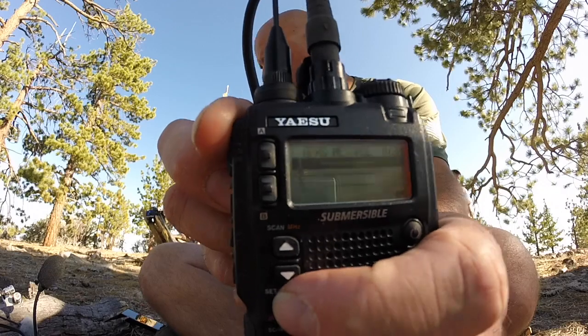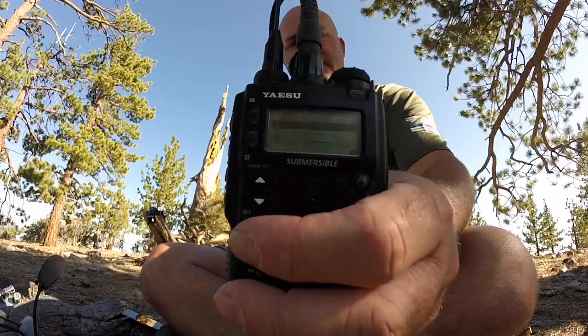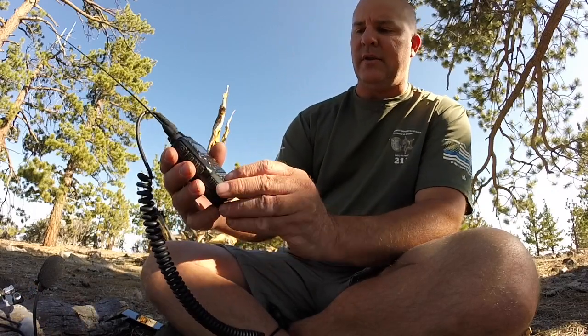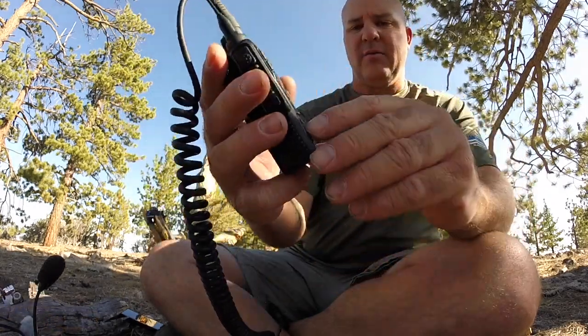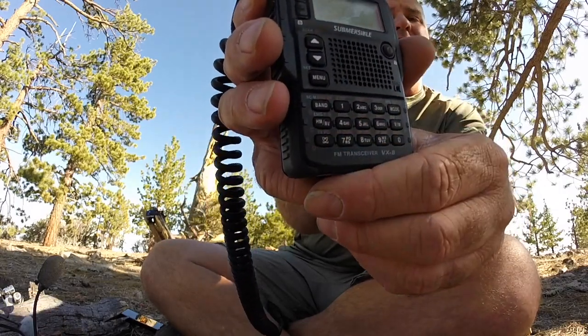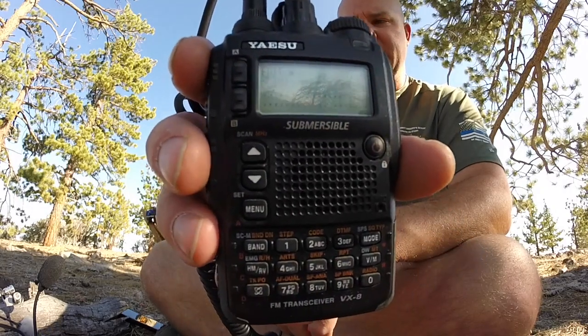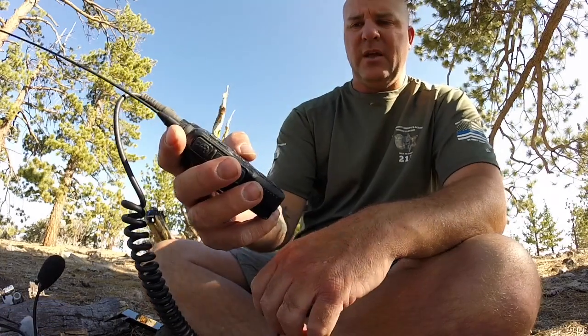The next one that comes up when you push menu again — see if you guys can see that right there — that is the APRS message screen, and that is where you will transmit and receive from. The way you put out a message on the APRS screen is you will hit the HMRV button down here, which is right next to button number four. Push that and you notice it comes up 'Edit' and then you have your little message screen right below it, and you're just going to type in it using the alphanumeric keypad. To go to SOTA, one of the things I had forgot — a little rusty on last Sunday — was SOTA.